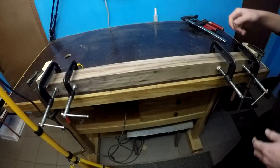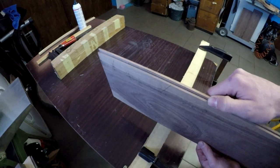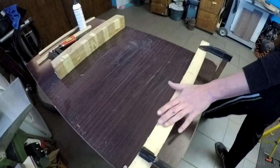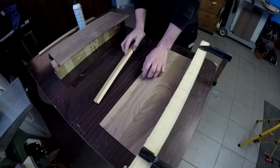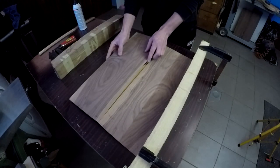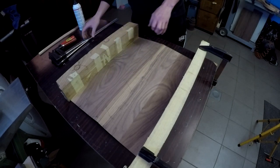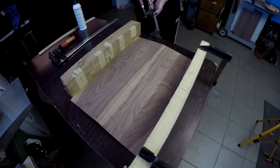Why didn't I teleport to the future where the clamps were removed? So I have something thin to glue together, but you're scared that the clamps might ruin such a delicate edge? Well, solution. Clamp on a thick piece of wood, put one workpiece on the other one side, put a piece of wood in between, put the next piece of wood next to it, get another chunky piece, put it directly against the second workpiece, and just clamp it down.